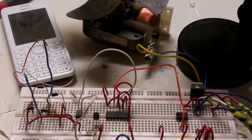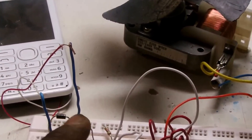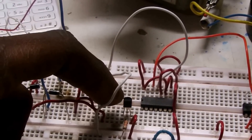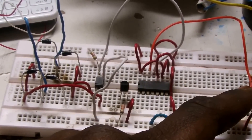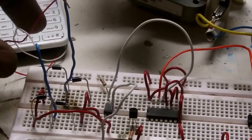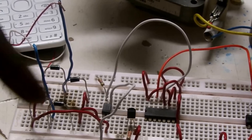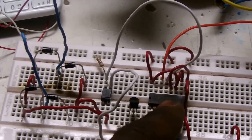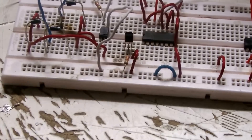So I have put my setup here. There is the phone, the signal cables, a bridge rectifier here, then an optocoupler, then a CD4027, and then another optocoupler. I have used a bridge rectifier here because I noticed the signal that I am picking has no polarity, so I create the polarity over here — minus and plus — going to the optocoupler, then to the IC. This is a flip-flop circuit.